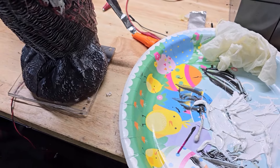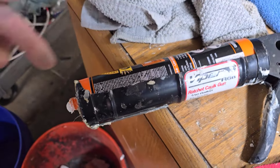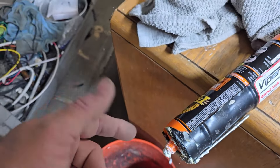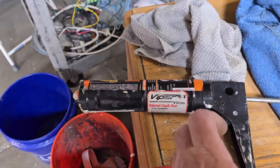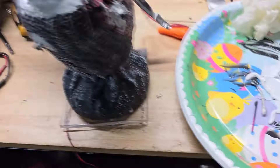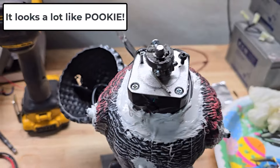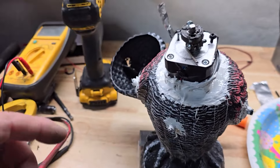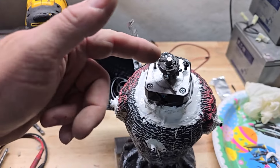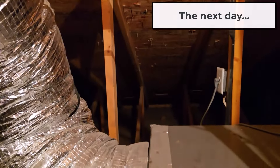I just took some old Gorilla Glue - almost a full caulking tube that I had used a little bit of. I was able to take the end off and get to the soft stuff, but it must be kind of frozen down inside - took a lot of pressure with the trigger just to get some out. So I wasn't able to apply it with the caulking gun. I wanted to squirt some on here best I could and then slather it on with a glove, which made it a little more messy than I wanted. I need to let that skin over on the outside, and then I'll put some sealant - JB Weld or something - when I drop the head on.